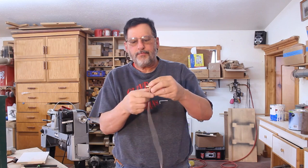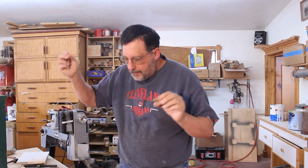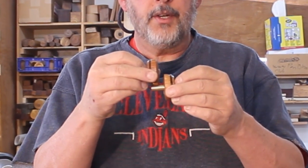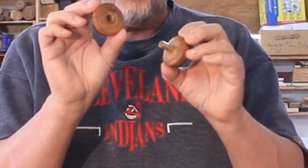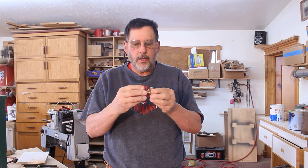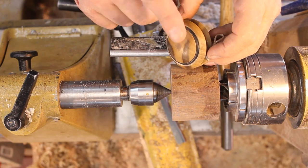What I've got in here is a hollow brass tube that the string winds around - that's the axle. After you're done you can fine-tune the width of your string groove by just moving that back and forth, and glue it with some CA glue. I've got a wooden part on each side with the brass tube in the center. I like this method because, as I showed in my first video, you can chuck this up between centers and it's very accurate. Then you can put those together, look at them, fine-tune them, and finally weigh each side to make sure it's in balance.